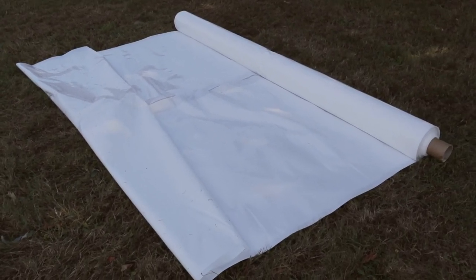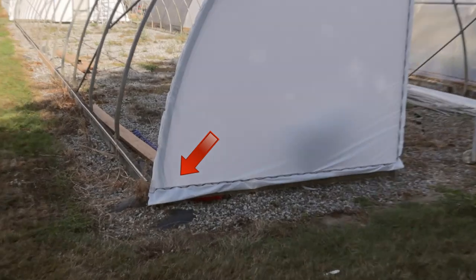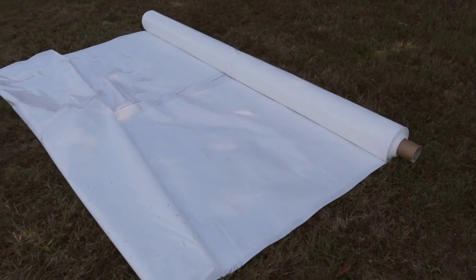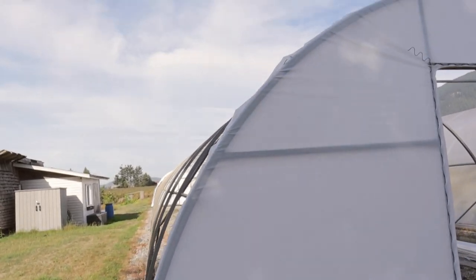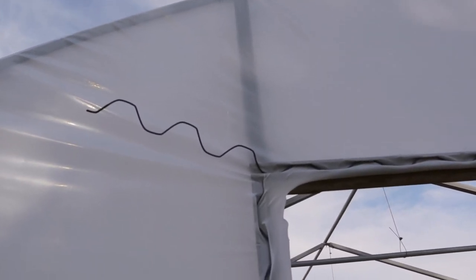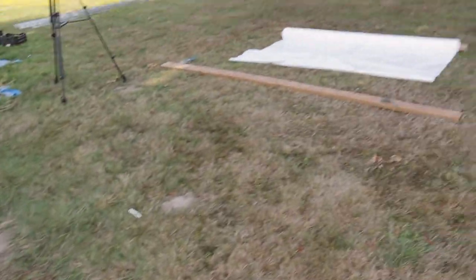You have to measure what will fit over the top of the structure. You take a string and run it from the bottom corner over here, all the way across the top, and then down to the other side, to give you the width of the roll of poly needed. I also had to make sure I gave enough length so we could cut off from the ends and install the ends first. We wiggle-wired the end section in, applied the poly straight across, and then trimmed it. You can see there's a little excess wiggle wire sticking out — I'll come back with wire cutters and cut off those extra springs so they don't whip around in the wind and cause damage.